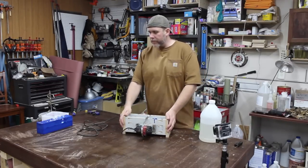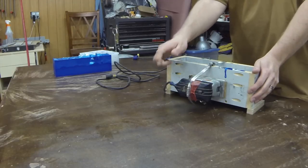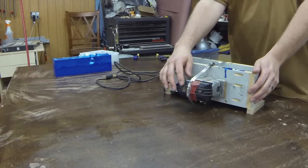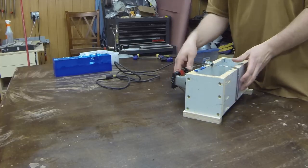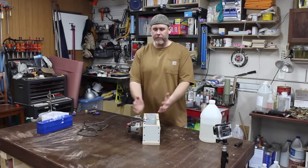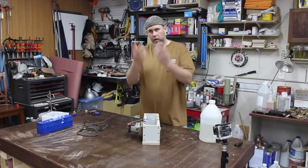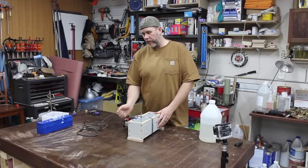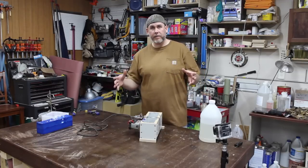One other thing that I did, because I couldn't use pressure, I strapped on one of those palm sander things, the vibrating ones. This is actually a 1940s Dremel sander, so vintage stuff. It worked really well. It vibrated the whole mold, and it forced the bubbles up. That's a trick that I kind of learned from people that do concrete countertops and that kind of stuff.